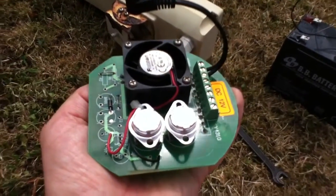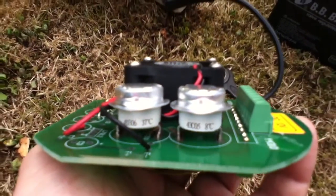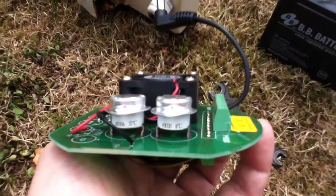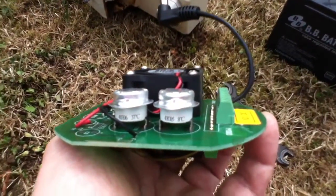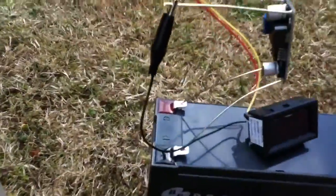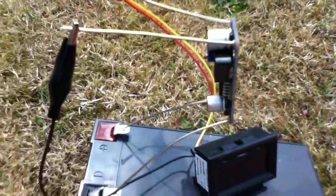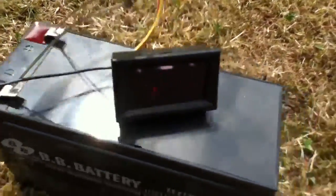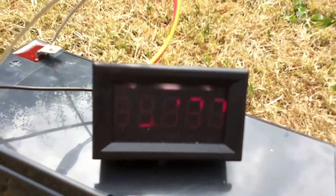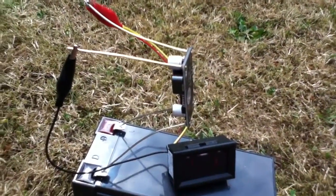Here's the board from inside the camera module. Looking at those thermal sensors again: the one on the left says 37 degrees, so it turns on when the temperature inside gets over 37. The other says 8 degrees, almost certainly turning on when it gets below 8 — that'll be for turning the heater on in winter. Now I need to mount my regulator module. I've used this basic switch-mode regulator module, which I'm going to set to 5 volts. It's sitting on a 12 volt battery, and I've set it to just over 5 volts — it's reading 5.13. I'll now attempt to fit that into the module.